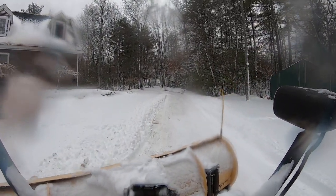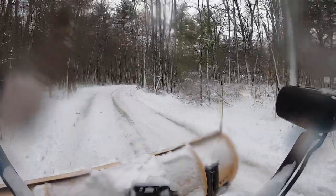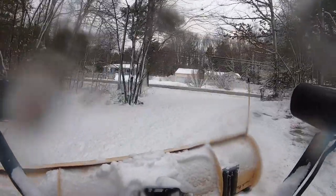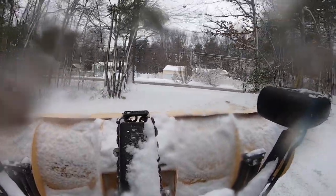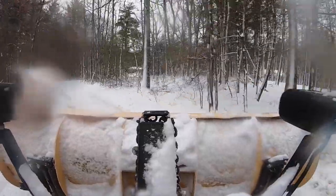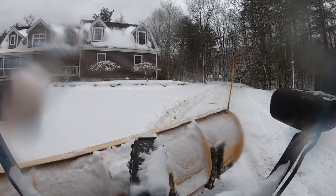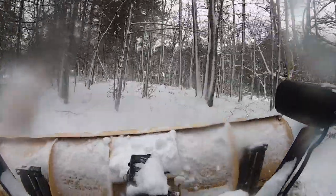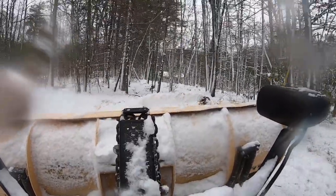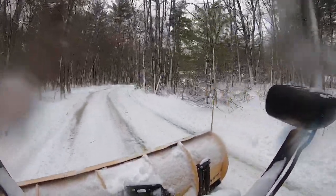Now we're making a pass on the left side of the driveway again. Plow is angled to the left, coming down, keeping it angled — you don't want any snow coming out to the right since we already plowed that. The goal is to not plow the same area twice. Turn, raise the plow, boom — right into the snowbank. Backing up now. This corner is tough to get the snow, so we're going to plow a little bit straight. Angle the plow, pushing the snow, then straighten out to build a little extra bank. This corner with the radius is tricky, so going straight a few times works well.